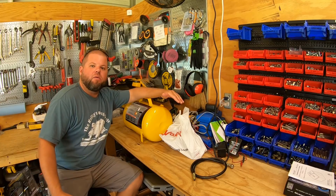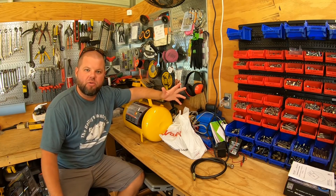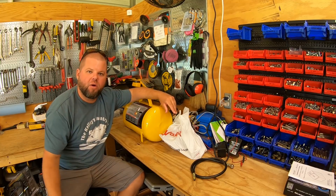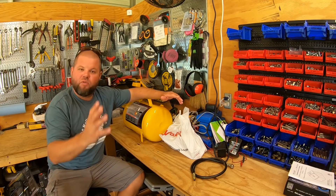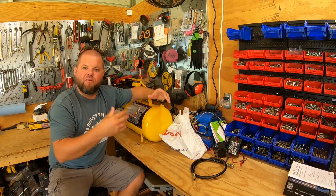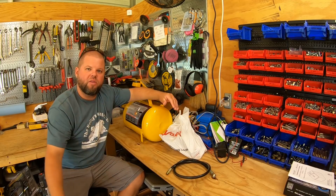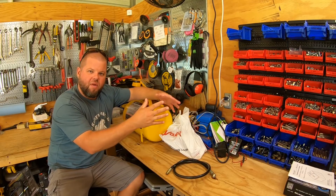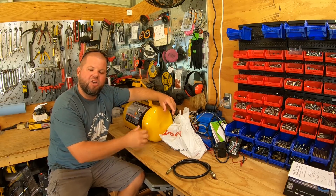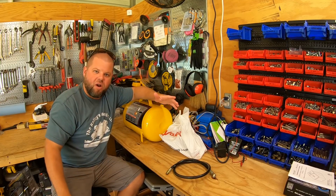So what is the purpose of an air receiving or surge tank? At my last job we used to call them air receiving tanks. Our compressor station would be a quarter mile to a half a mile away across a mill before it would reach a certain department. Air does not travel well due to restriction down small lines and hoses over a long length. These hoses expand, they contract - there's not much flow. And when you're doing back-to-back nailing, you need a surge of air, a volume right there to fill that air gun very quickly.